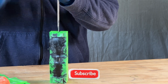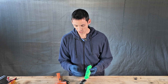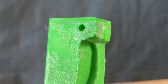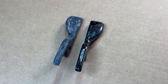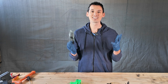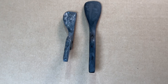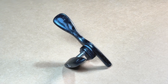I'm not sure exactly how many parts I'll get out of it but I definitely should get a handful. The only cleanup I've got to do is clean up all of the mold release, which is all water soluble, and just where I had to pry the part out there's just a tiny bit of scuffing — but honestly it's so minor you almost can't even feel it. In the previous molds I made a left and a right side mold of the handles, but on this design I'm able to use the same part for both the left and right sides of the airplane. I just love when you can reduce a design down to the simplest form. I also made the part much bigger and a little bit thicker, so the part looks way more refined. It looks awesome.